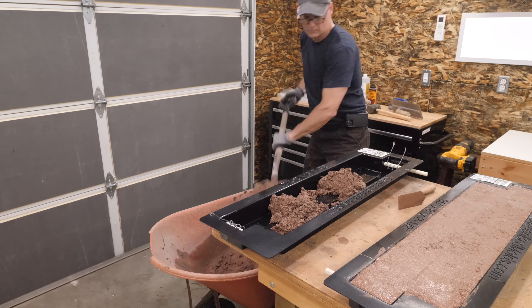Both lightweight concrete blends are nice to work with when filling the molds — easy to trowel and pretty responsive to vibration to help settle them. I then mixed another batch of the vermiculite blend to fill three 24-inch molds. I decided when editing this video to show the forms being filled a few times, and sometimes when I ramp up the speed, it's easier to see how well the concrete settles and how everything ties together — hopefully helpful for visual learners.